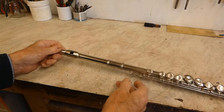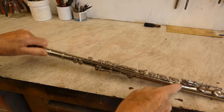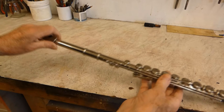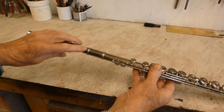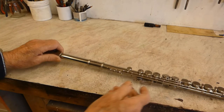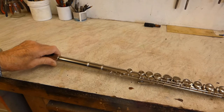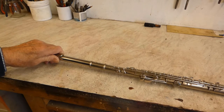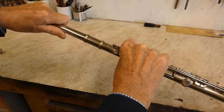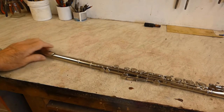So, first job really is to join up the three pieces, and because they're a sliding fit — airtight obviously to play the instrument — it needed a very thin, watery type of adhesive, and for that I use Loctite. Loctite number 603 is the one I use. It's very watery but it penetrates, and once it's in, it's in. It's not going to shift — whatever you do you're not going to turn it.